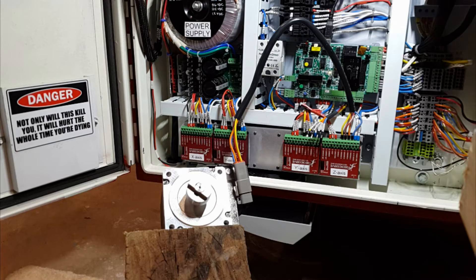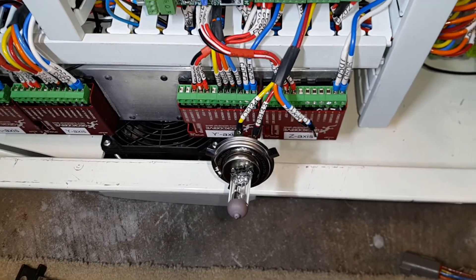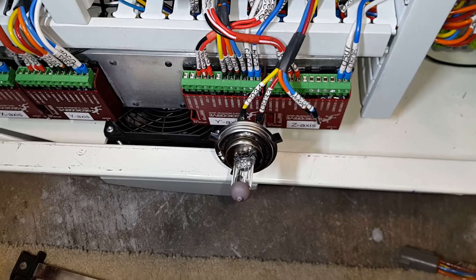This sounded a lot better to me, so I think it excludes the driver and its configuration from the problem. I'm going to focus on the cable and that connection. My next step is to test the conductors to see if they can carry current — my voltmeter says zero ohms, but that doesn't necessarily mean the wire is capable of carrying four amps. Here's my little rig: I just have an automotive light bulb and I'm attaching it here, applying power to the connector.